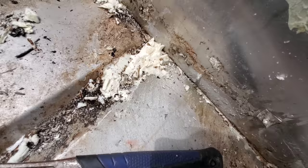The parts have been sitting for about 3 hours. Everything's cured up. Everything is ready to go. And as you can see, super, super slick. So what I'm gonna do is I'm gonna take my sander with some 80 grit, and I'm just gonna hit all these real quick, just knock the tops down, knock all the imperfections down, and then scuff the surface good to give that carpet glue and carpet something to bite to. So let me do that, and then we'll get to wrapping carpet.